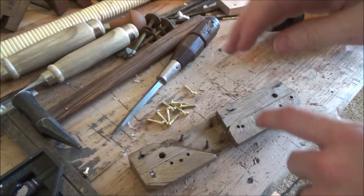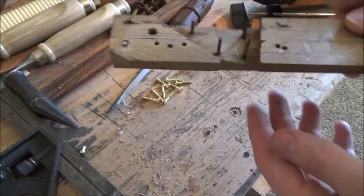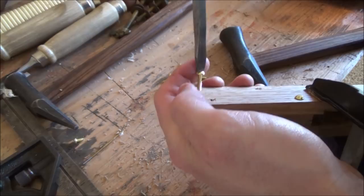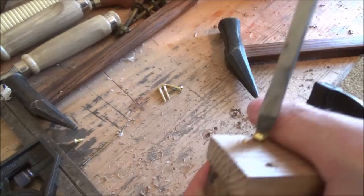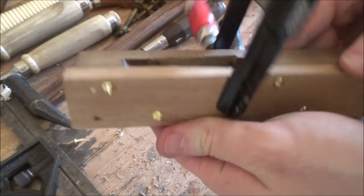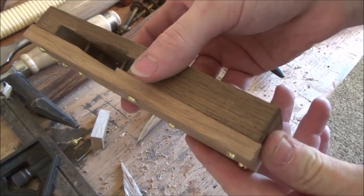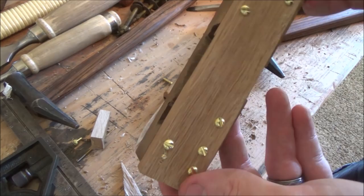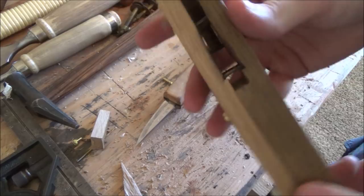Spot gluing has worked. We're going to get this on here, put some screws in it. I decided not to countersink all these screws since I just don't really like the look of the previous ones. If you like the look of countersunk screws, that is perfectly fine. As I always say, it doesn't have to be pretty, but it does have to be practical. Ladies and gentlemen, we have it — kind of a rough face transplant there, but we did fix the problem. The gap is gone from where the two other blades sit. I'm going to cut this thing down flush on this side, trim up these edges, chamfer them a bit, and we'll put the blades in and see what kind of result we can get.